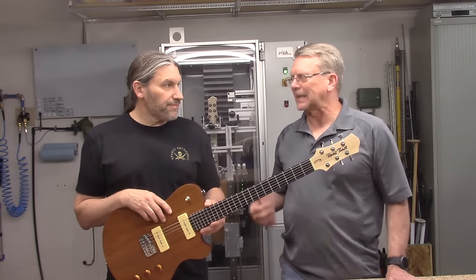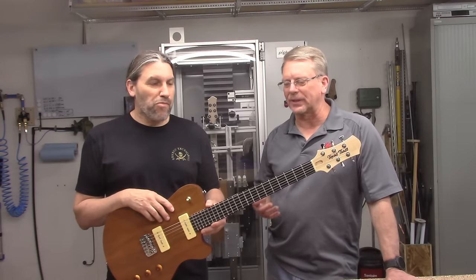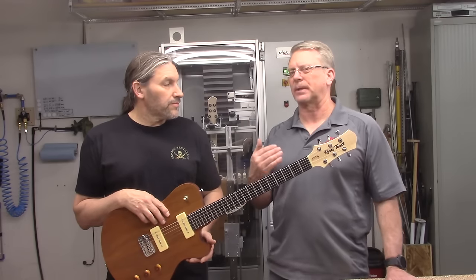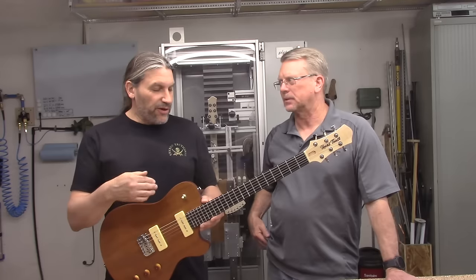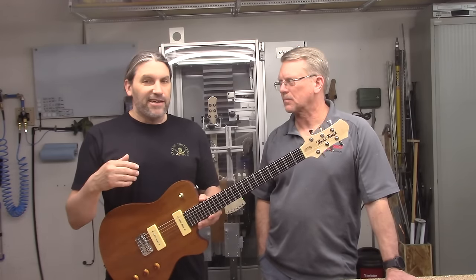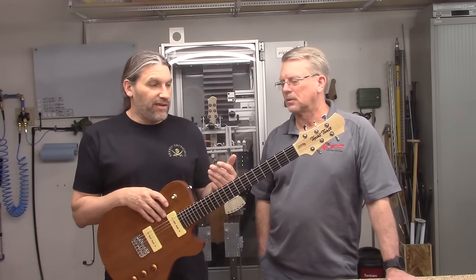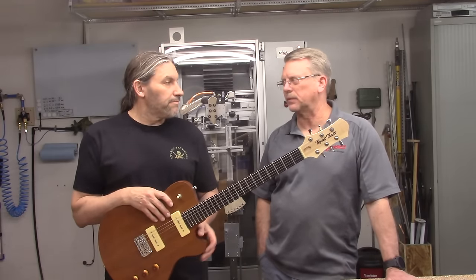We want to leave as much there as possible. Well, that's exactly what this is doing, exactly what any fret dress does. It only takes off when it has to. So to me that's not a valid point, because what you're gaining is the precision. If your fretboard is good and your frets are good and you press them in correctly, this should have very little work to do, but it'd be the same work you'd have to do by hand, only it'd be perfect every time. The consistency of it is the key.